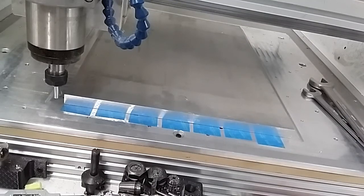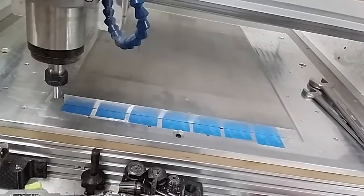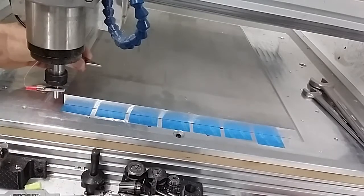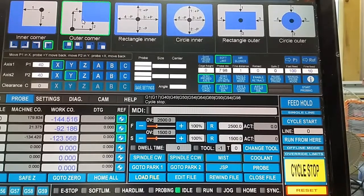Doing initial setup. Because I've got an aluminium bed here I can't use a normal electrical touch probe. The probe bit here is insulated from this part, so to use it I clip the sense signal on there and the other part goes on the bed. I use the outer corner test because I want to find where zero zero is. I've got the gauge set up — my pins are 7.98 millimeters diameter — so I've got the count gauge on both those. Click on there and we start probe.